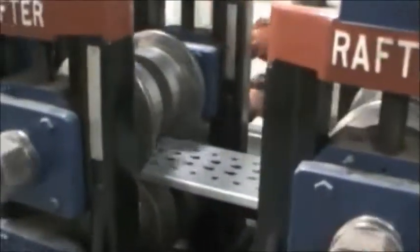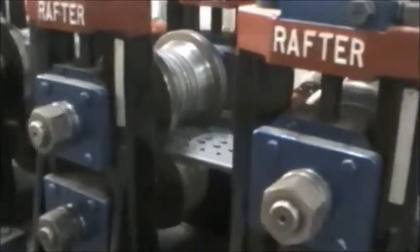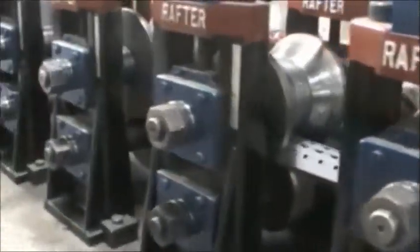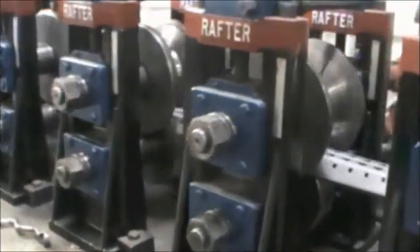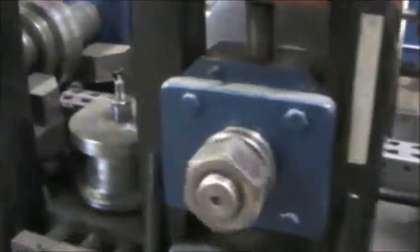It's a kind of a bend in each one. It's 7/8 of an inch. It ends up at the back of the column when you're looking at it. As you can see, it's going down. You could identify the bend in the front of it too. And each one of those bends has to be within a thousandth of an inch in order for the beams to hook on the way they're supposed to.